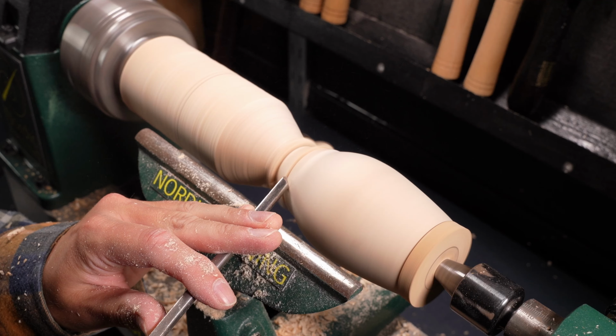I'm not sure you can see it, but the bottom has these ripples in it. My hand won't fit to sand the bottom properly, so I came up with a rather unusual solution. I have this finger belt sander that might do the trick. It fits nicely and actually does a great job smoothing out the bottom of the bowl.